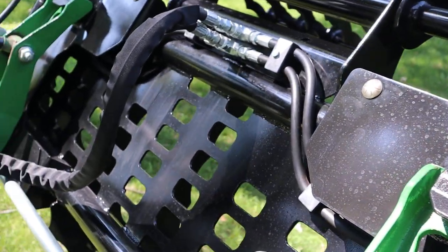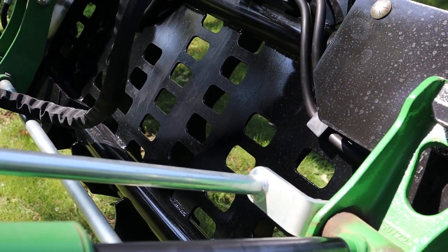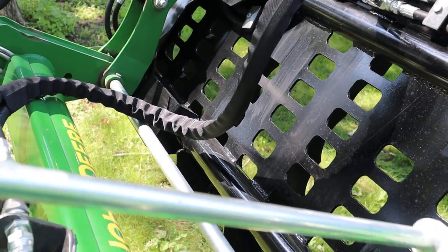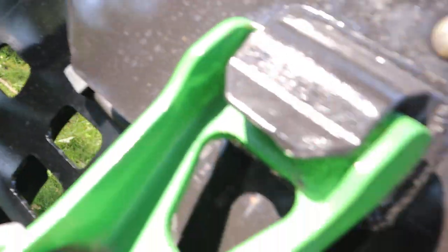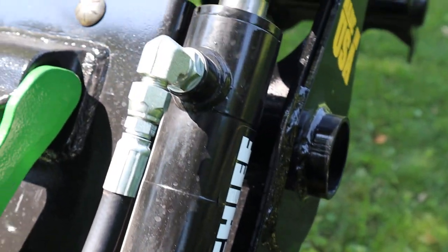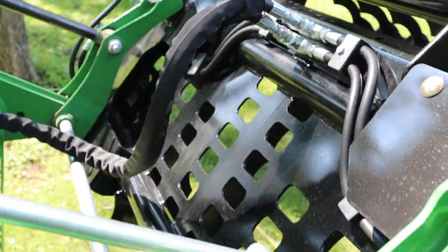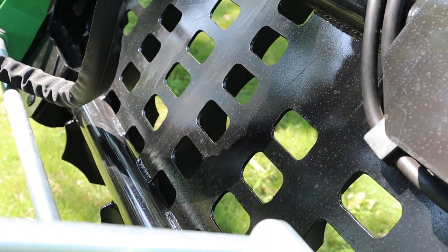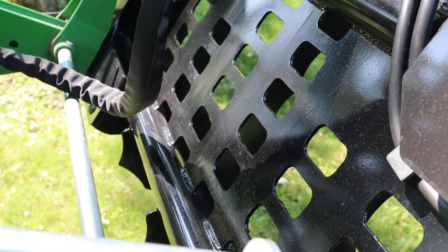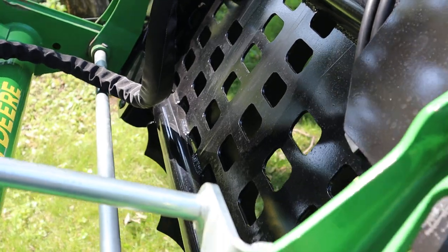One other neat thing is the way we protect our hoses and protect the tractor. We have an almost completely enclosed back and run the hoses all the way from there, back around that plate, tie them into the tensioner, and up to the hydraulics — easily replaceable if you do break a hose. That's a 3/16-inch plate on the back side with slot cutouts. We didn't want to cut visibility down too much, but we wanted to protect the tractor as much as we can, and we feel we accomplished that.